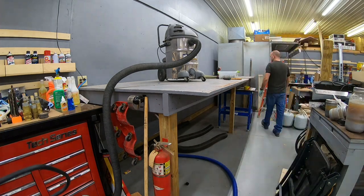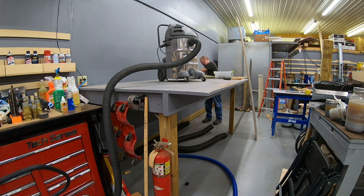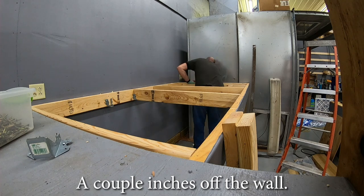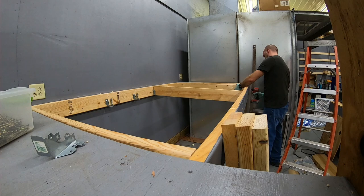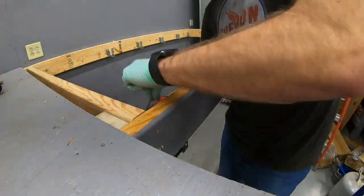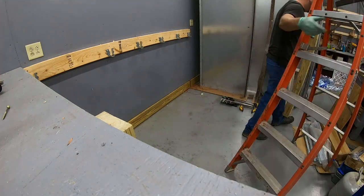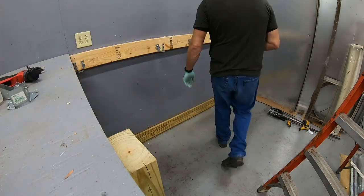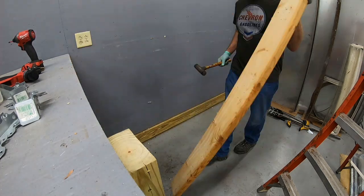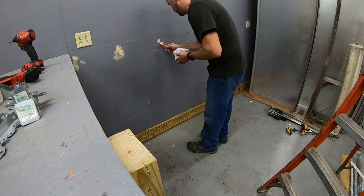As I pointed out, the plywood is hanging over the edge of the framework by about a foot. I originally only built the framework to be 4 foot deep, but once I built it I felt it was not deep enough. The shelves are 24 inches deep — I set a couple inches off of the shelf and that just didn't leave much room to walk. So I decided to increase the depth and instead of rebuilding the framework, I just let the plywood hang over knowing it wasn't going to support anything but occasional foot traffic. I did truly build the new mezzanine from scratch with all new material, mostly due to the change in design. It was also easier to leave the shelving in place on the original mezzanine until the new one was built, then move items shelf by shelf.